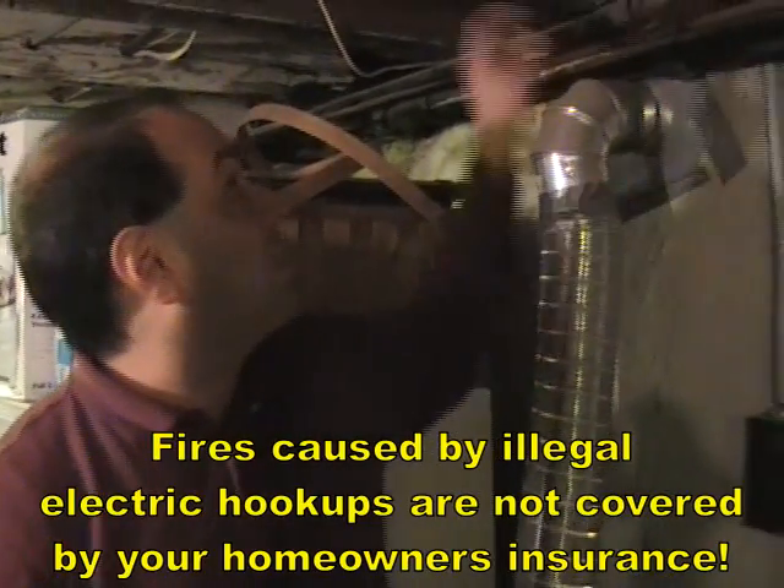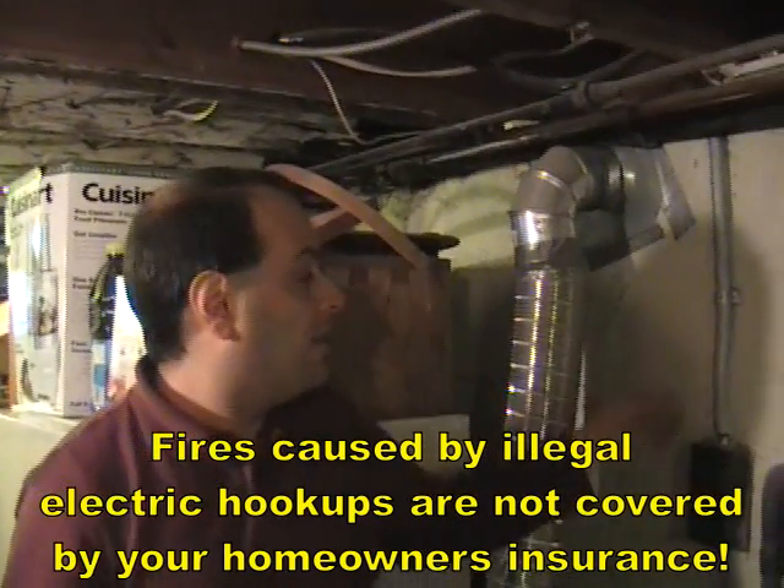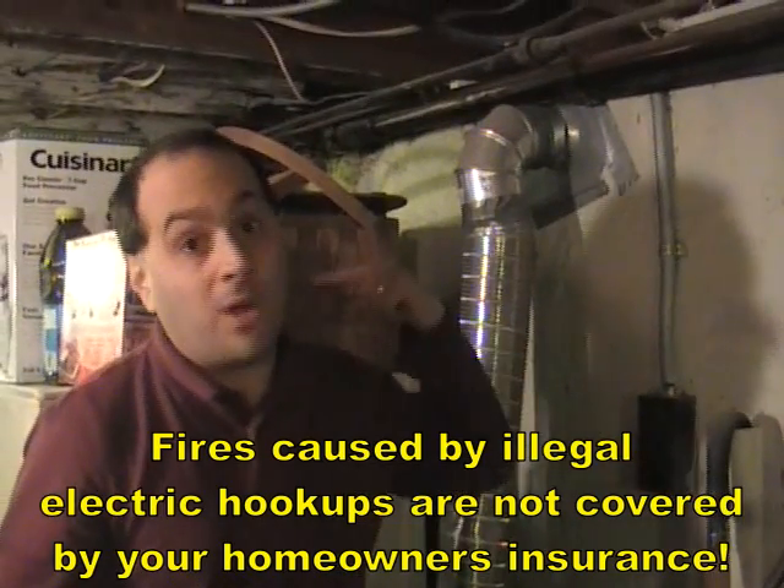Fire marshals for various towns will tell you there are documented cases of people burning down their homes because these cables were not designed for backfeed — you're feeding at the outlet end, but the circuit protection is all the way back at the panel. Also, it's illegal. So: backfeed — don't do it. The rest of this video is dedicated to showing you how to do this the right way.